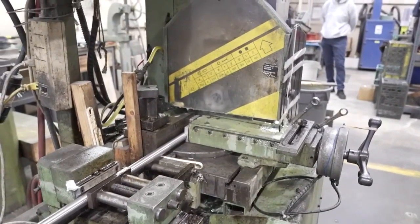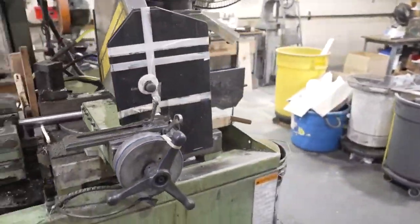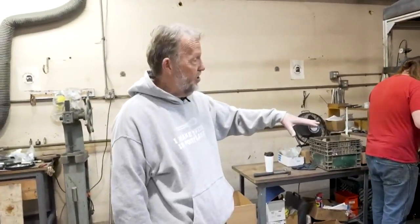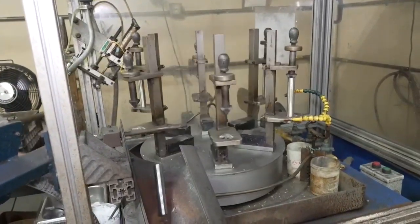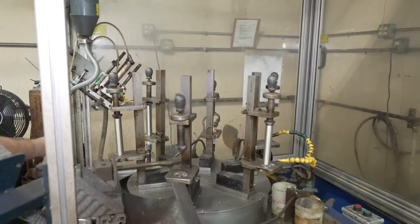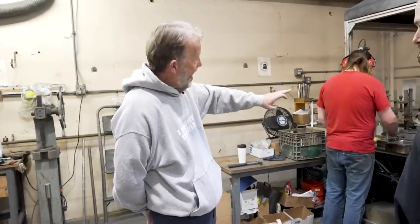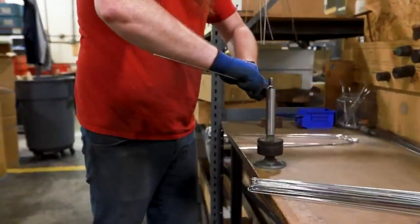Well, from there we will finish the assembly of the handle over here on this brazing machine. Let's go take a look. Okay. All right, our next step? Our next step is this soldering brazing machine where we fixture a bottom cap in the handle that's permanently fixtured from the inside, so no water, no food, nothing can get into the handle. And that's done on this machine here, which has kind of a series of torches and air for cooling. We paste the bottom, put the cap in, and as it goes around the carousel, it gets brazed and cooled. That is cool.